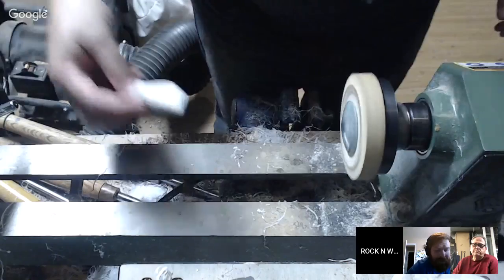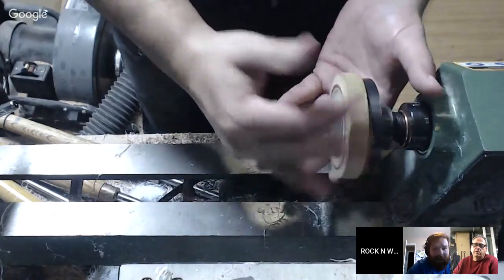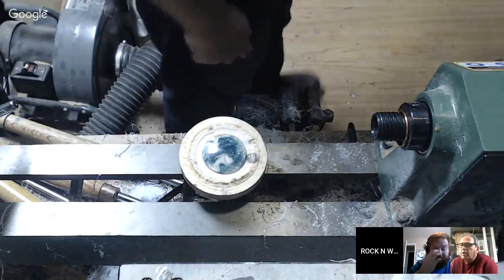I think what you're doing, experimenting, is probably going to teach you the best. Robert probably has better ideas. I don't know about that. But honestly, I probably would have gone with either hot glue or double-sided tape, just like you've already mentioned. I don't even have double-sided tape, and I'm just getting into hot glue now because I'm doing some hybrid pen blanks. I just put a dab of glue on the wood piece of the pen blank, and then I pour the resin around it so it doesn't float. I do have a heat gun, so I'm able to put some heat on that hot glue spot, and it melts enough that it'll release, and then you can clean it up from there.